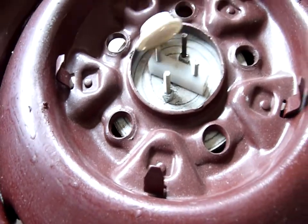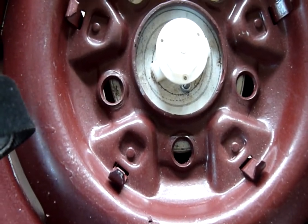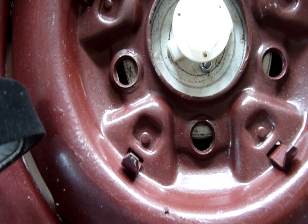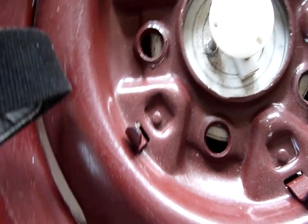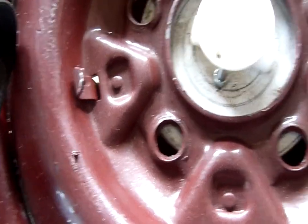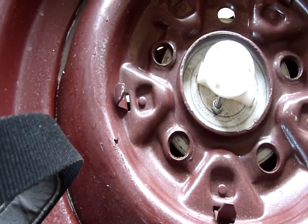Here are the rings — you can see about a sixteenth of an inch gap. Keep a constant position while standing and get it as close to centered as possible. Turn a quarter turn and check again — a little bit off, it's got to come that way a bit. If you don't have it level, it's very easy to get confused. So I'll just center that and then I'll show you how I balance it.